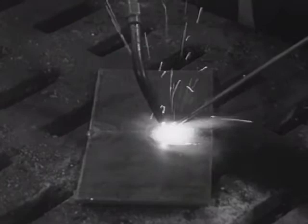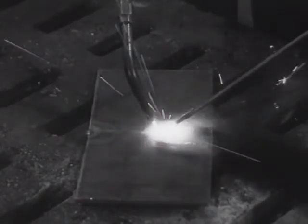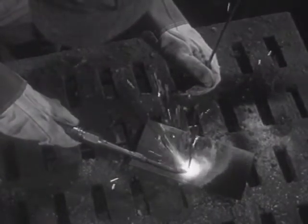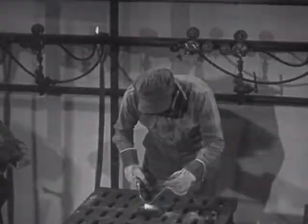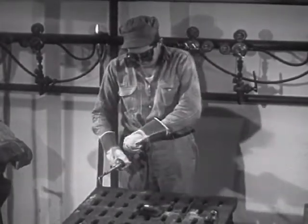The pieces of metal to be welded together must be prepared properly so they are free of any foreign matter. They are held in position with due allowance for shrinkage. When the flame is passed over the edges, the metal is quickly heated to a plastic stage. The welding operator uses a welding rod of metal similar to that being welded. The metal from the rod is melted into the joint, thus fusing the parts into one solid piece.